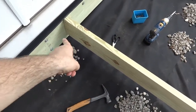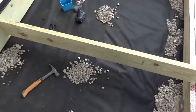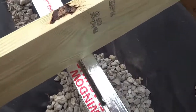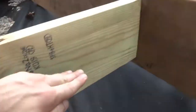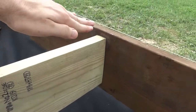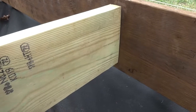To start fitting the joist I just took a tape measure, set it against the ledger, and measured all the way out to the front rim joist. With it being slightly bowed in, it was 82 inches, so I cut the joist at 82¼ inches, which made it perfectly straight and lines up right with my string. The only problem — and I kind of thought this might happen — is that not all the wood is perfectly straight. You can see that little black line showing where the top of this needs to be. It's sitting a little high, so my best bet is to cut a little wedge notch right here to drop it down. I'll probably have to do it to all the joist boards since this one seems slightly bowed down.